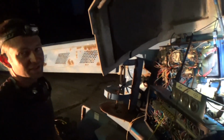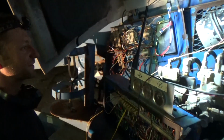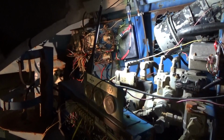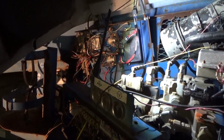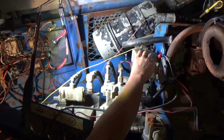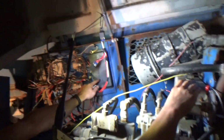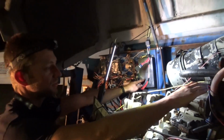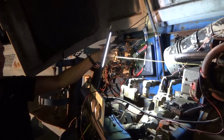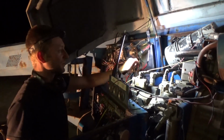So you're saying it should be like a 10 amp fuse instead of 15 amp, or what? I think, with 5.4 amps, you never want to operate at the fuse limit because it'll overheat the fuse. You need to at least go twice as high. So again, we don't know if this thing drawing 5 amps is normal, and is that what potentially cooked this box. Now again, potentially, we don't know if the box is actually cooked or not, but this was here since the very beginning of ownership, so obviously this was a problem.